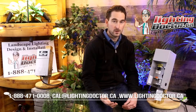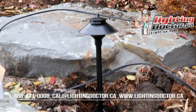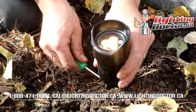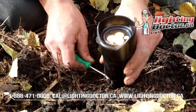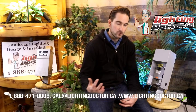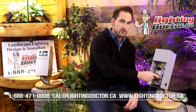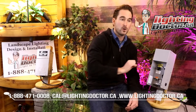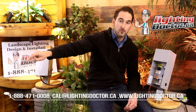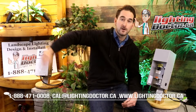A useful trick: say you have a system with 40 lights and you're worried the transformer isn't big enough — but some of them are path lights that only use 2 watts, so you can easily fit those 40 lights on this transformer. But you're worried about voltage drop because you have to run some of them long distances, say on two sides of a driveway. What you can do is put one line out of the transformer going one way and another line going to the other set of lights — 20 lights on each run. You're still starting at 15 volts at the tap, so you're only losing voltage as if you had 20 lights instead of 40.